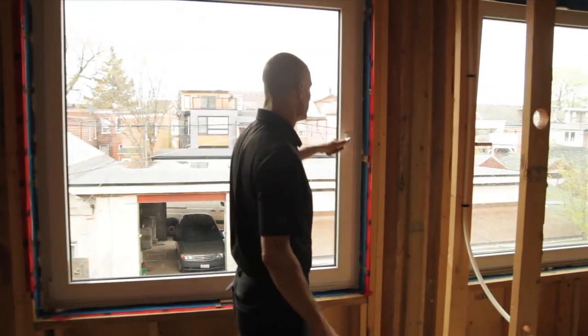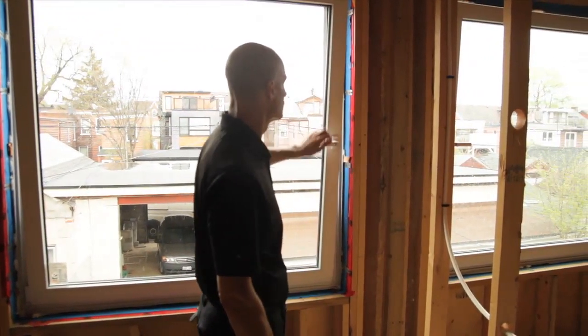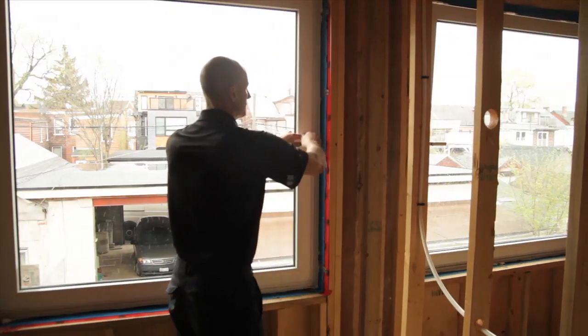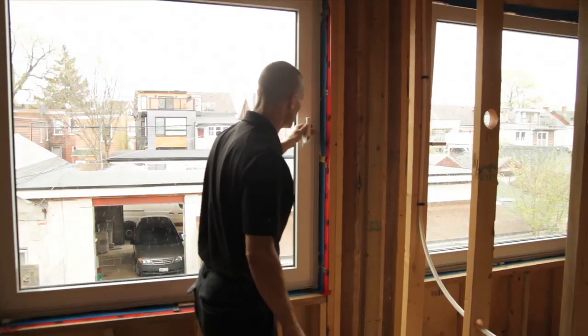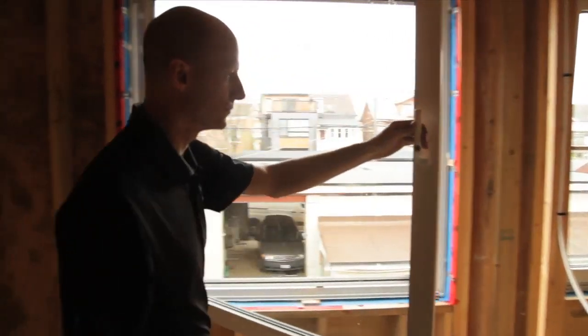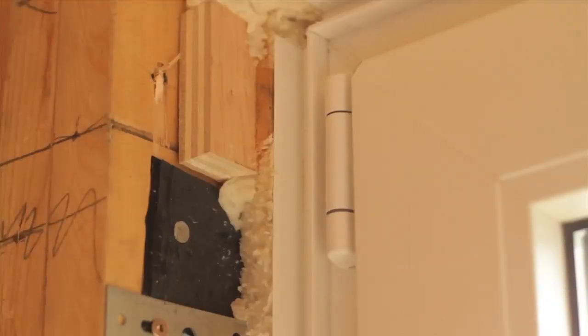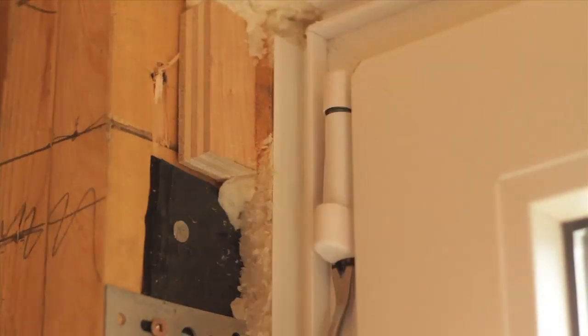The sash can be removed and replaced to facilitate easy installation. Often, the frame is installed into the opening without the sash in place. Once the frame has been installed into the opening plumb and square, you can reinstall the sash. To remove the sash from the frame, start by removing the upper hinge cover. Once this has been done, you have exposed the upper hinge pin.